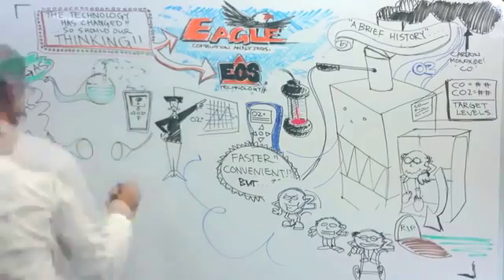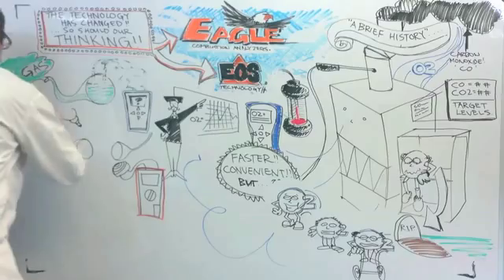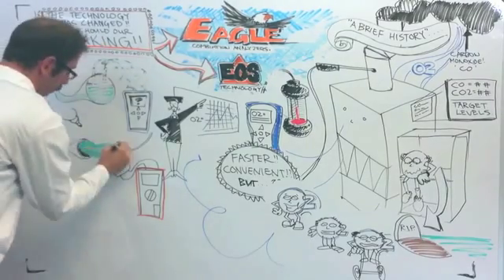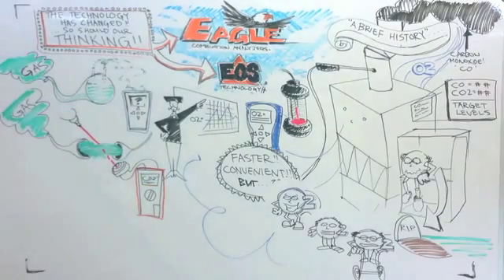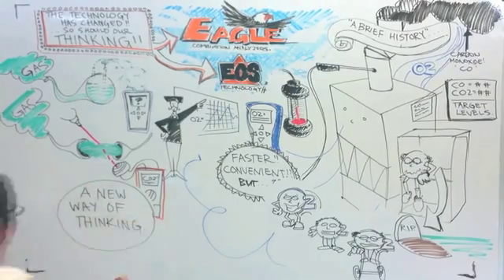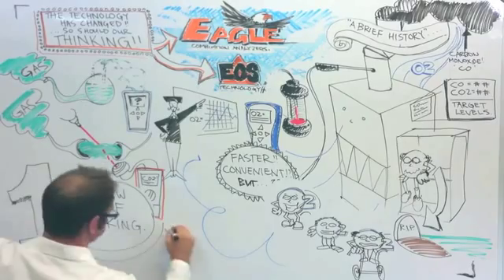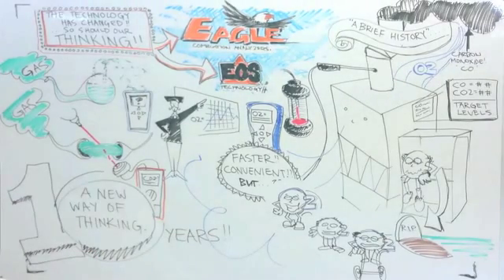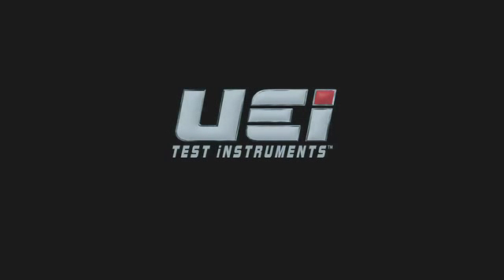Now let's talk about EOS sensor technology. We started first by removing the electrochemical O2 sensor and replaced it with an electro-optical CO2 sensor. Sample gas passes through a chamber where an infrared sensor scans the gas, detecting the amount of CO2 in percentage. The advantage here is that the gas never comes in contact with the sensor to wear it out. That's a direct measurement — not a calculation — of CO2, from a sensor with no calibration deterioration and a 10-year life expectancy. Our EOS technology is a new way of thinking, and it's exclusive to UEI. Of course, our competition is going to try and talk you out of using this, because it's something they can't offer you.